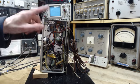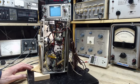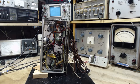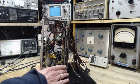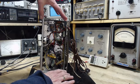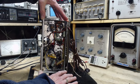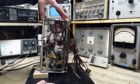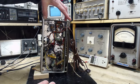So that's a hint right away that the B minus wire is not the chassis itself. There's a separate B minus circuit, which is quite common in these radios, and that introduces a problem which has to be solved. If you have no connections to the chassis at all, the chassis is just a big piece of metal. It's rather like an antenna, and what's against this antenna is all these parts and coils and things doing things, and the chassis begins to carry some of those signals around in the radio.